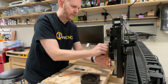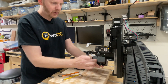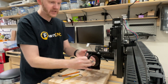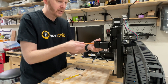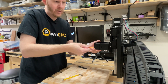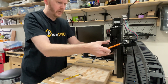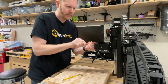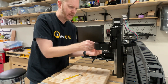I've got all the screws on there, and now that we have our mounting plate — our adapter plate — on there, I prefer to have the slit in the mount on the right side. There are various mounting holes for additional accessories; I'm actually working on one I'm hoping to release pretty soon. You're going to mount the right side with a couple of these long screws. The spindle should basically mount almost perfectly center on the carriage. I'm going to position both of them pushing down with equal force to make sure it's in a nice position to tighten down the left side screws. The right side screws you wait until you have a spindle sitting in place.